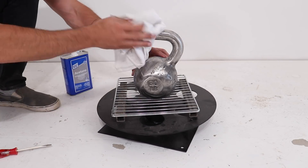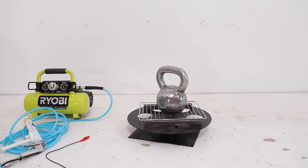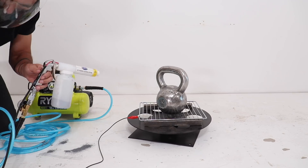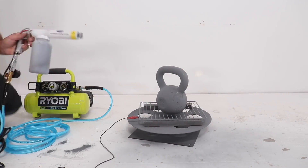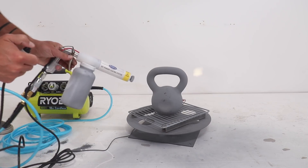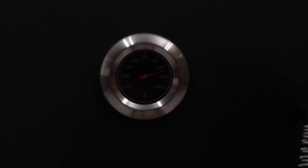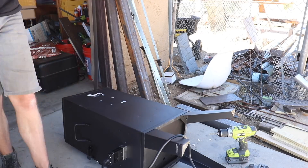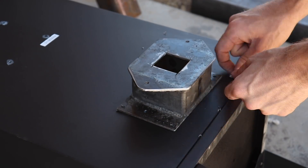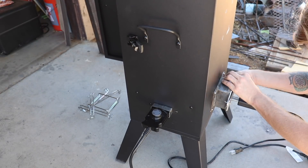For the big kettlebell, I decided to try a powder-coated finish. After cleaning it with the angle grinder and paint stripper, I wiped it down with acetone. Powder coating is a highly durable paint finish that comes as a powder you spray on with a special gun using static electricity to make the powder particles stick to the metal. This dried powder is then baked into a smooth, shiny glaze in an oven set to around 400 degrees. I got one of these electric smokers and thought it might work, but after leaving it on for a couple of hours it wasn't getting hot enough. So I enlisted the help of Brett from Skull and Spades — we cut a hole in the back and added another heating element. I found an element at Home Depot that's actually used for igniting charcoal: no control on it, you just plug it in and it starts heating up.